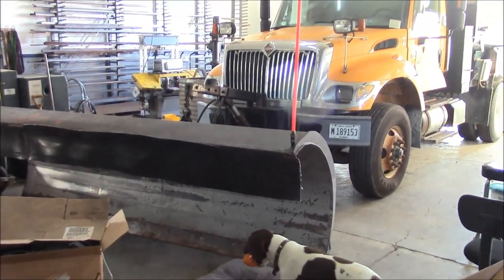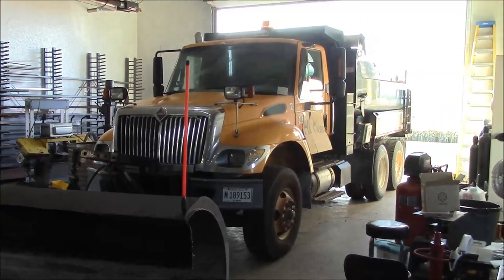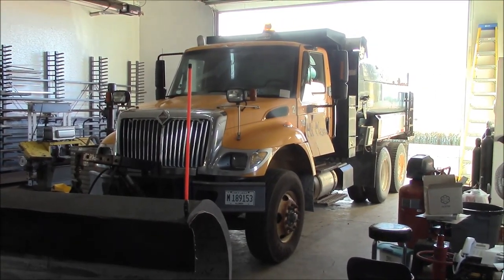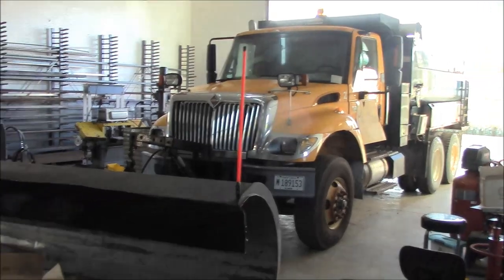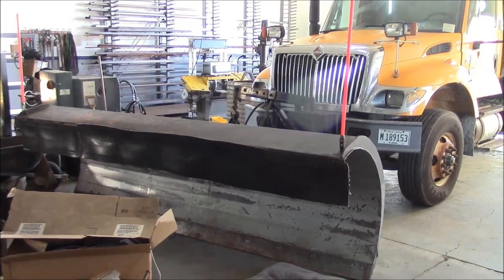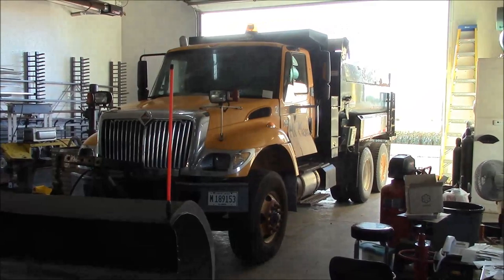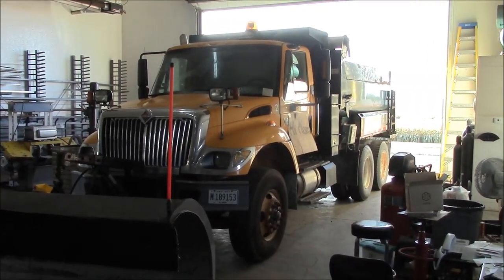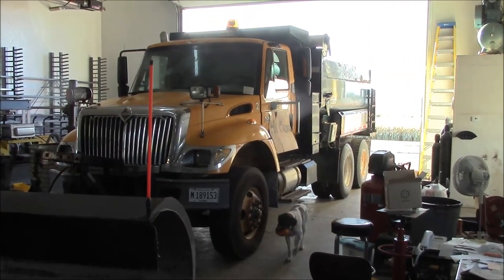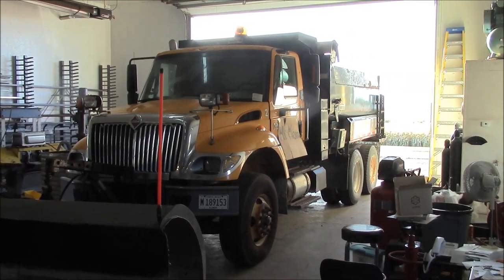I don't know what's going on with this truck. He says they just went through a state inspection, but I noticed the air dryer is purging about every 30 seconds and the ABS light's on on the dash — so I'm assuming they didn't pass. I'll have to talk to him about those various issues. We'll fix that drag link and the plow frame, and we're going to have the batteries unhooked anyway to weld, so we'll just hook up the amp meter and see if there's something going on. That could be a real wild goose chase.